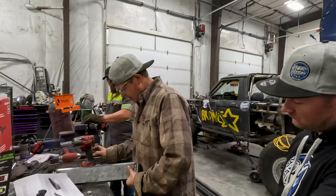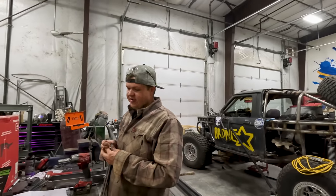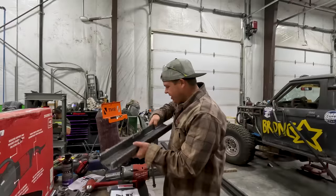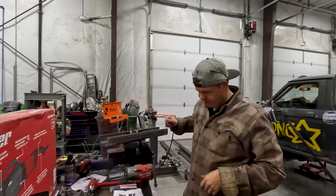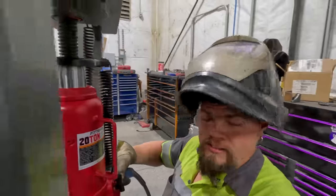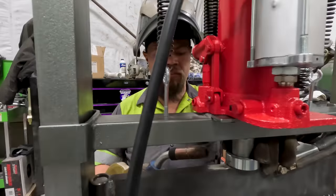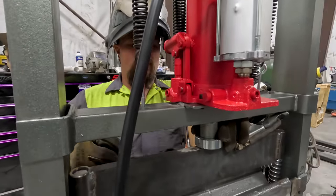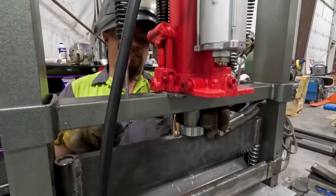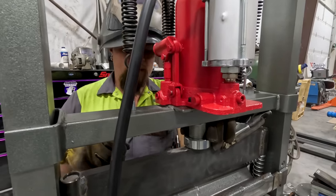This is our die. This is just the version of this. Before I go too far and screw up, I'm gonna put these bolts in. I'll go weld these in, and we'll get to pounding this together. Okay, I'm gonna tack this in place, release it, make sure it's gonna go back into the thing with ease and not be off center or anything. And if it does, then I can fully weld it. If it doesn't, then we have to cut the tack and move it again.